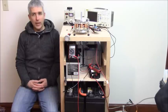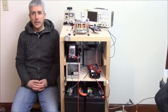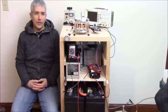So we have to do that with limiting the current flow in the coil. We want to really just turn on and off the coil as fast as possible, which is not giving you very much motor action. And that's what the original 10 coiler was. It didn't have any torque whatsoever. It didn't really have a lot of speed either, because it didn't have the ability to build up speed with the lack of current flow.